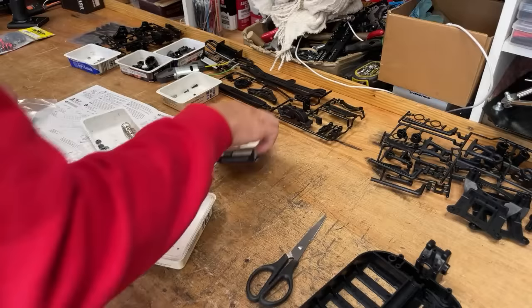So servo, we need to get straight. So I've got a servo tester. Plug him in there. Then you plug the servo in the other end. And you can get these on Banggood, actually. And any model shop really should have these. And you can make sure the servo works. If you hit that and put it in centre, that puts the servo in neutral. Right, so now go ahead and put that servo arm on there in the central, or as central as possible. And then we've got to get a screw to hold the servo on.